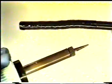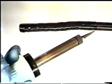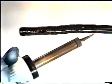If bubbles appear in any part of our epoxy, we can take what's left of our glue and fill in any bubbles or holes that might pop out during our gluing. Another method to get rid of any bubbles or debris is, again, use your soldering iron and gently touch epoxy to fill in hole or remove debris.